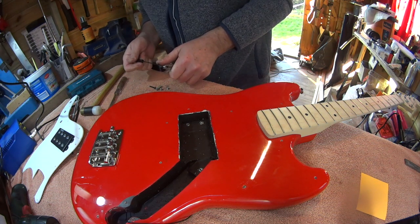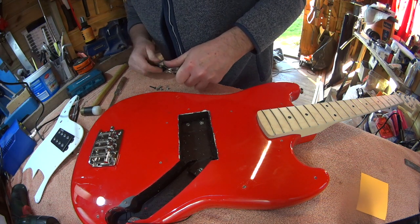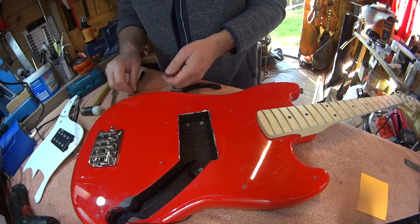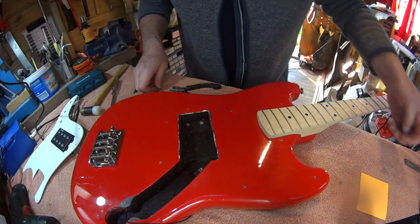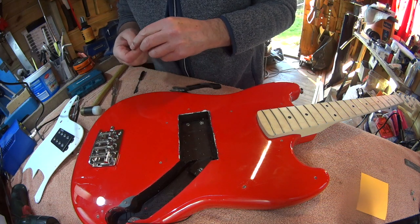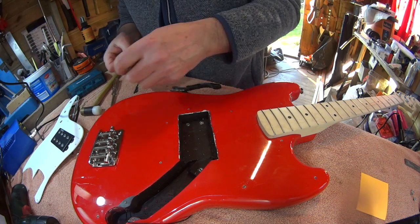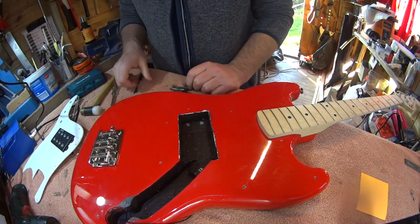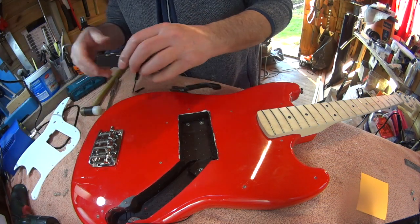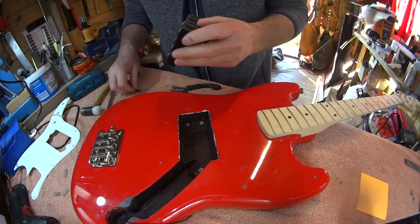It does feel like the end of this is just ever so slightly burred. So dragging it through these three inserts should have helped it on its way a bit by recutting, or softening off that burr. If it won't bite on these things down here, which occasionally happens, then if it doesn't bite on there, I will put some grease in it. That's what I'll do.